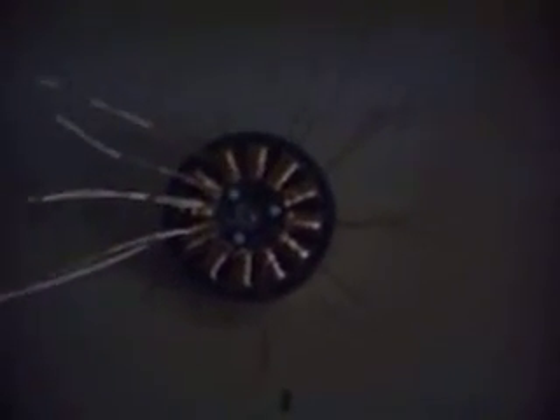Probably low amperage, but never mind. What I'm going to do is, diagonally opposite coils — as you can see there, there are 12, so they're all symmetrical. Diagonally opposite coils will be linked together in series, so it doubles the voltage.